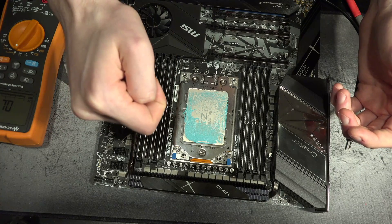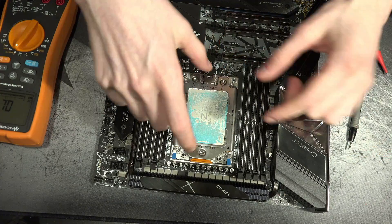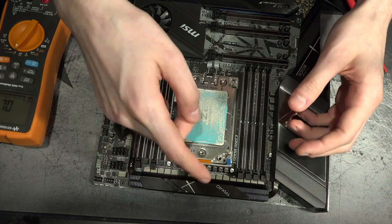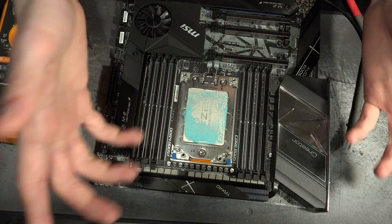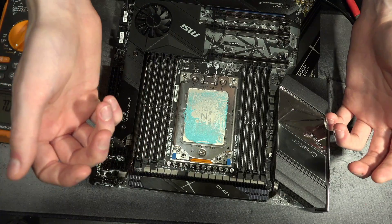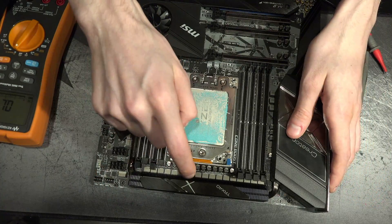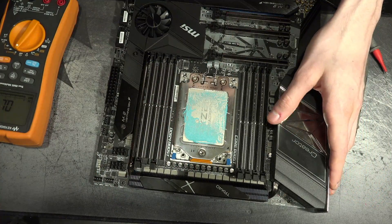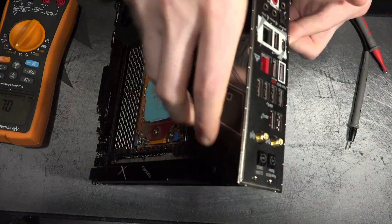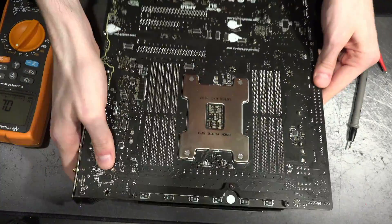Normally there's a 100-ohm resistor going to the VRM sensing, so when you install a CPU, the CPU's die sense has near-zero resistance to the controller. With the CPU installed, the VRM output voltage is no longer visible to the controller because there's a voltage drop across the power plane, through the socket, into the CPU — you don't want the VRM output voltage skewing the die sense measurement. With the CPU installed, if we find the die sense circuit we'll measure the CPU's resistance across it; without the CPU we should see around 100 or 200 ohms.